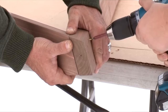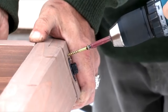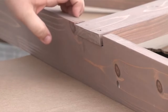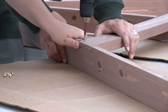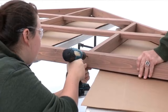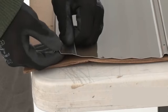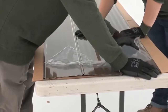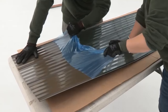When attaching the end of the rafter to the fascia beam assembly, make sure the top of the rafter is flush, then attach with a wood screw. If the end of the strap top, mid strap, or either of the bottom straps aren't flush with the edge of the rafter corner left or right, have someone hold the boards in position and fasten with wood screws. When attaching the rafters, fasten it to the bottom first where it connects to the fascia beam assembly, then fasten it at the top where they connect to the rafter corner left or rafter corner right. Gloves are essential for this part of the assembly because roofing material can have sharp edges. To prevent scuffing, remove the clear and blue protective film from both sides of each aluminum part just before you use it.